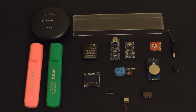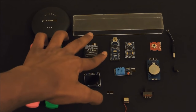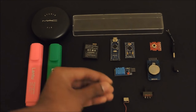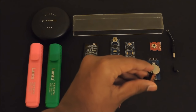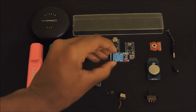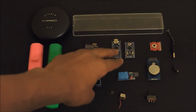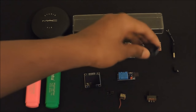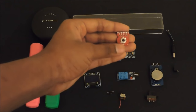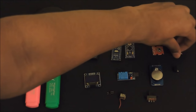The things you're going to need for this project are: two highlighters, an OLED display, a 3.7V LiPo battery, a micro pin header, a tiny switch, and another switch with three pins, a DHT11 temperature and humidity sensor, two Arduinos (you can use two Pro Mini or two Arduino Nano), a DS3231 RTC module, and a five-way tactile switch — this is like a micro joystick — and a wire connector.